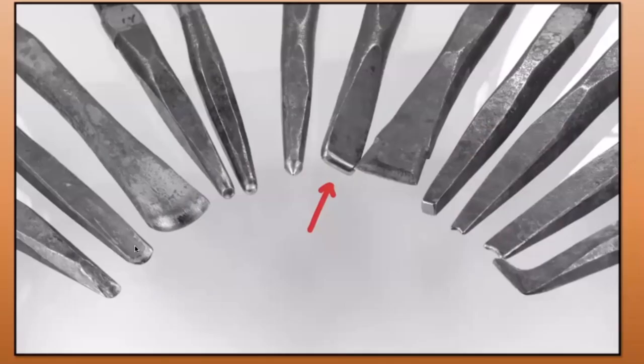So these are the tools that we're going to use for our bear's head. And I'm going to use this fuller. This fuller is about 5/16. This one is just a standard half round at 5/16. You could also make it with a little bit of a draft on the back, which would push down for the cheek. But this is the tool that I'm going to use.